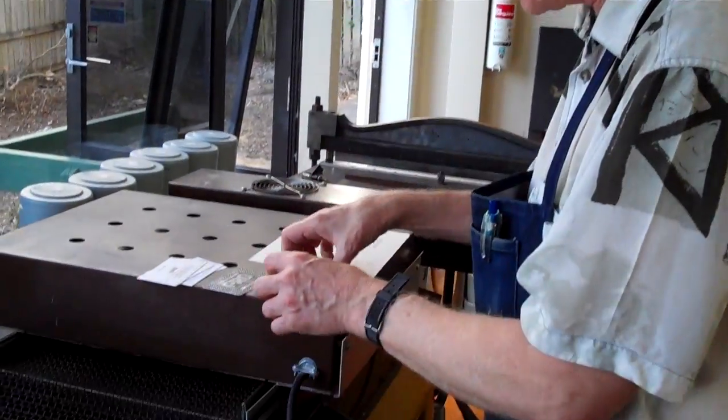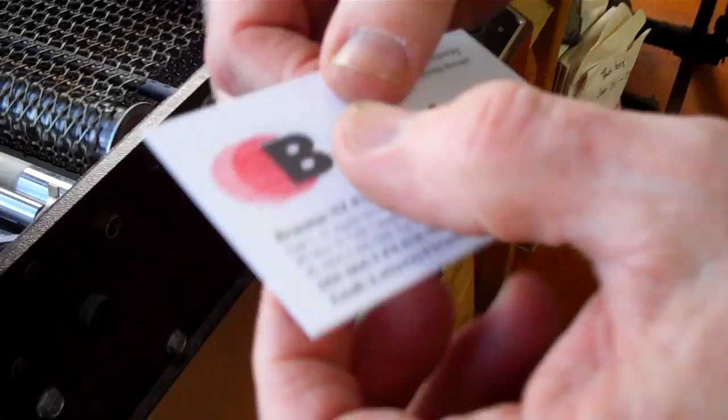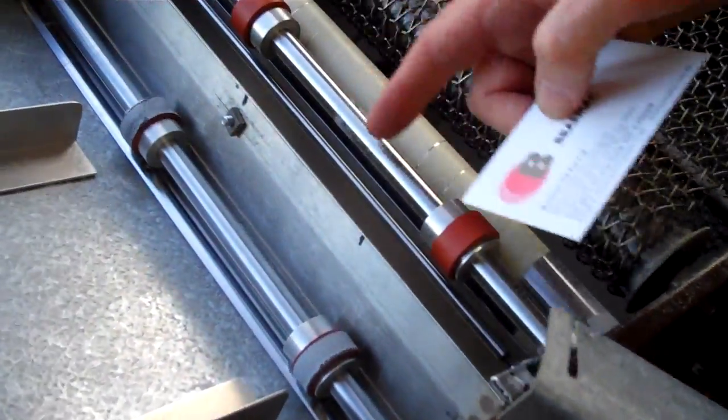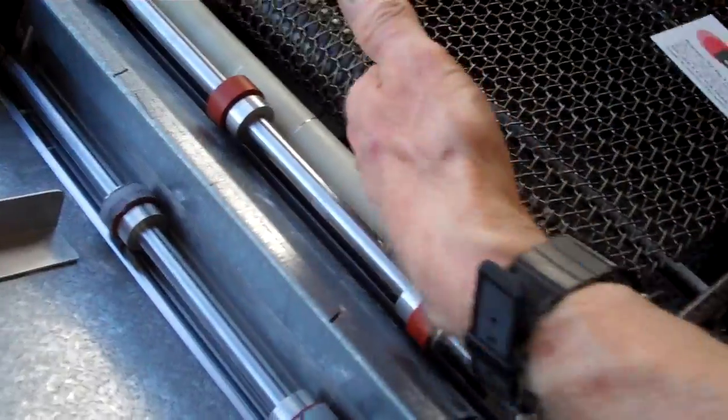Graham, tell us about this machine and what we can do on this one here. This is called a thermographic machine, or heat raised printing. So what happens is, if you wanted something like your business card with your logo raised — you can feel it actually. What you do is print them on the press, bring them over here while the ink is still wet, they go through the little trough there with powder in. They come out here, go underneath the heating elements, and it kind of melts the powder into a raised sort of blob on it. So you can feel it, and it really is quite different.